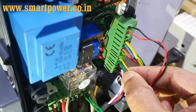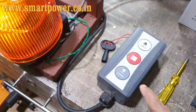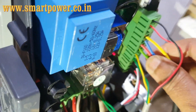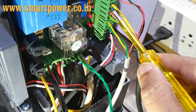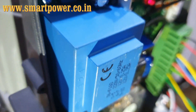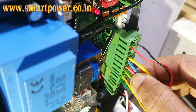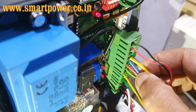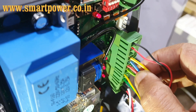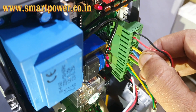The yellow and green wire is the NC connection for the photo cell — in this model, the NC connection of the photo cell is used. These are the four wires for the manual push switch. Pin number seven green is open, pin number six red is close, pin number five blue is common, and pin number four yellow is for the stop condition.